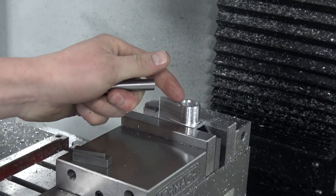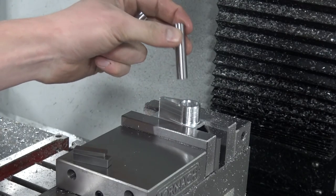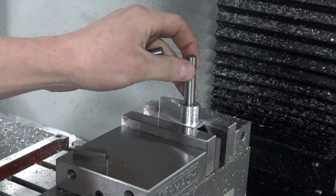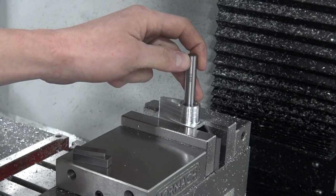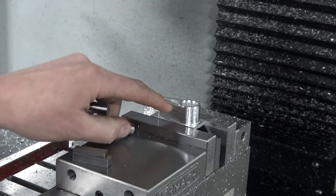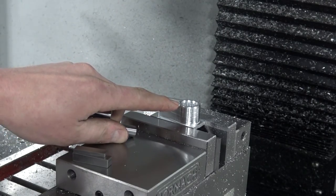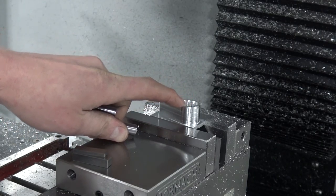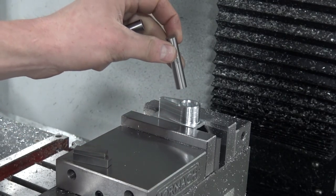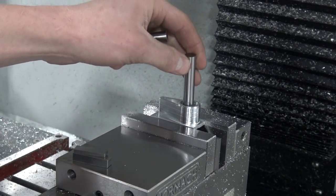Now this is a clearance pocket anyways, effectively, the way we're designing this. And so the question is, well, wait a minute here, why are we off a thou? We can do better than that. And I wouldn't get too worked up about it. First off, mostly because the tool tolerance on most end mills is plus or minus 2/10. And so if you assume, and that's an assumption, that the end mill was undersized, that's 2/10 on each wall, and that adds up to a pretty good amount just right there. That would be 8/10. That could be explaining it.